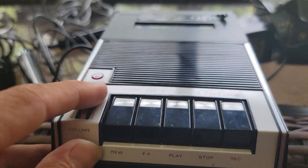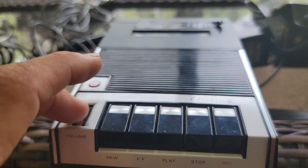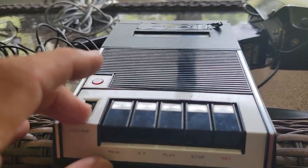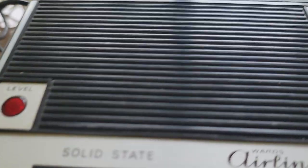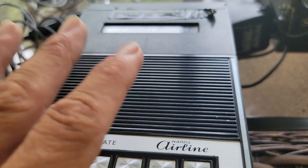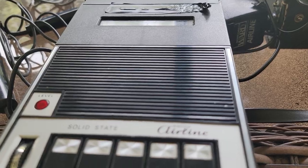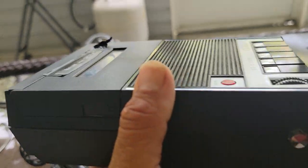I found a cabinet stereo at one of the thrift stores in Fort Walton. Again, I told everyone: don't dare plug it in — you could fry a component so quickly. Even with an old vintage radio, you have to go over it thoroughly. If anything's out of tolerance, like a capacitor that shorts, don't plug it in or you'll damage more components.